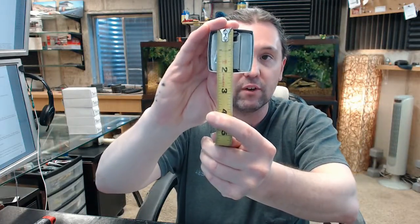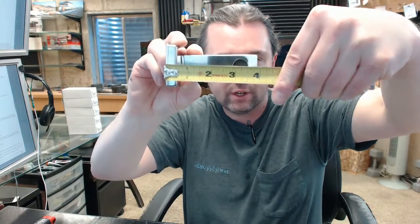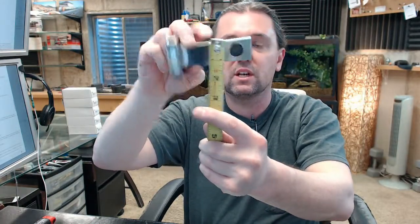The arms have typical 2 inch by 2 inch mounting pads or escutcheons, which is found very similarly across the entire ASI line. The projection of the arm overall is just under 4 inches, and about 3 and 3/16 inches to the centerline. Height of the arm is about 1 and 1/16 inches, and thickness of the arm is about 9/16 inches.